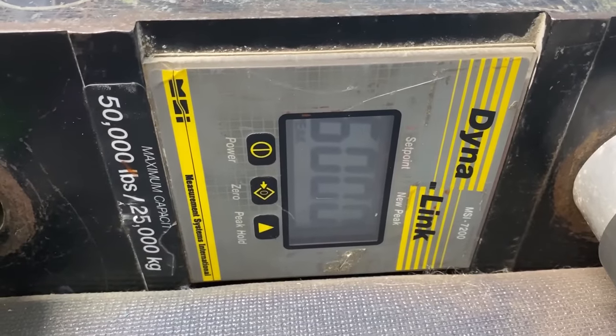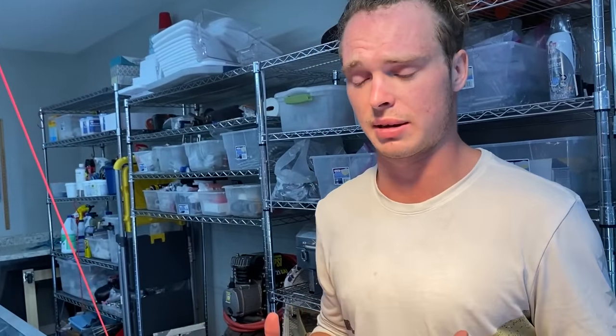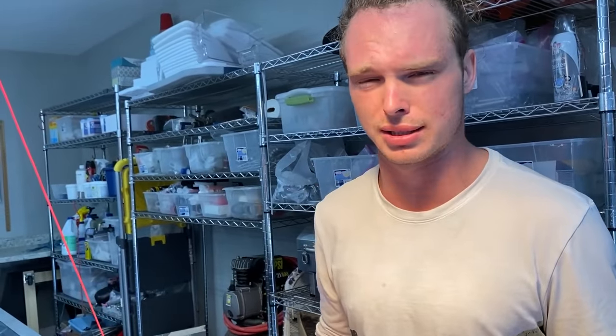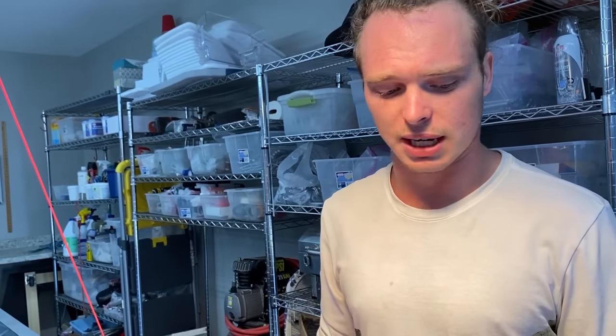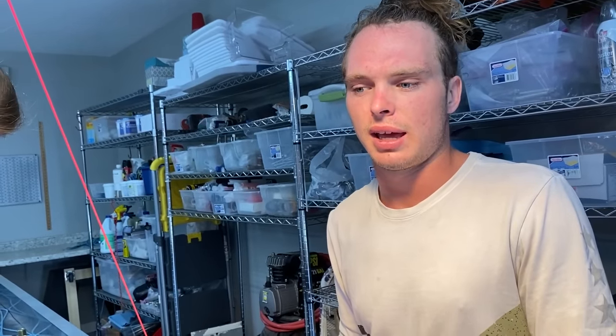27.1 kilonewtons, 6,000 pounds of force. So basically MBS. I think we just actually replicated what a typical scuff in a trick line looks like. It looks really bad because it's all frizzy and it looks like a mess, but it's actually only one or two strands, which seems like it's not as big of a reduction as I thought it was originally. So one or two strands is super good enough. If you're cut 10% through, that's not super good enough.